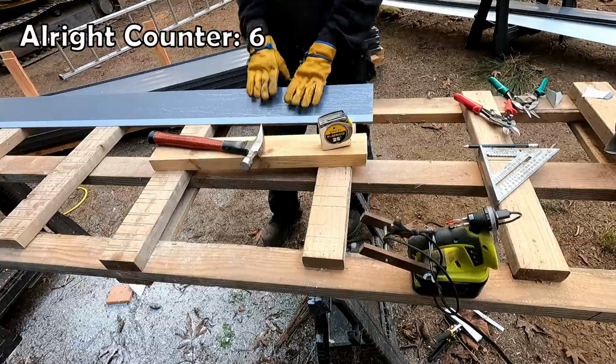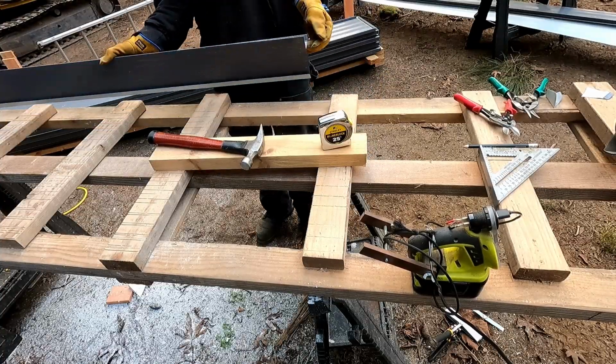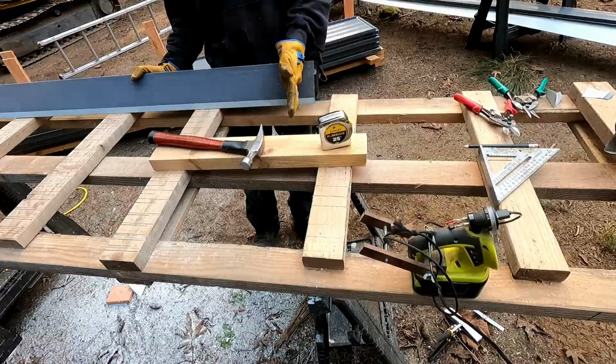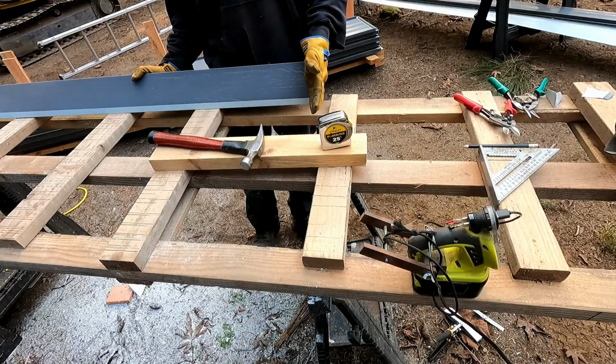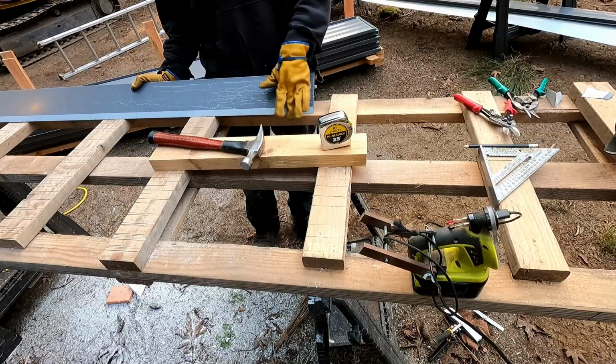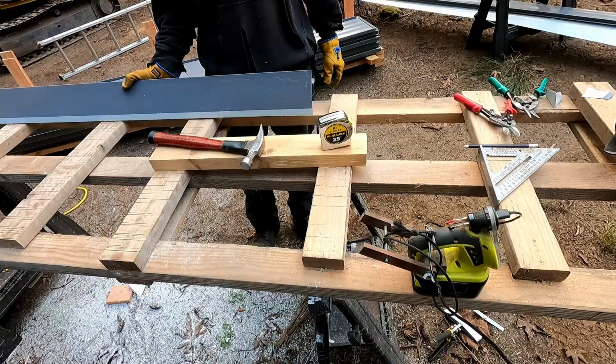All right, this is the extended eave that's going to go on the other corner. And essentially what I want to have happen is this have a straight fold flap that goes back along the rake, and then the top flange here, I want to come out far enough to hem into the rake piece, and then this wind-driven rain barrier here gets cut back to allow that to tie in, if that makes any sense.